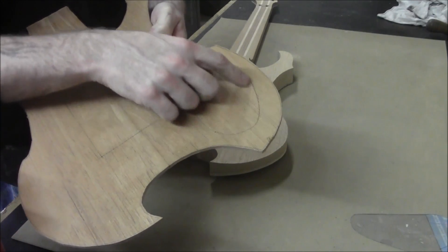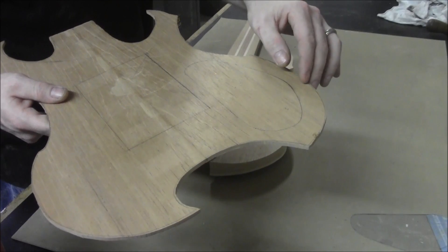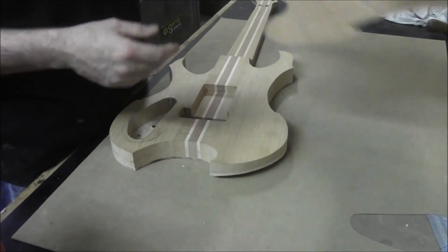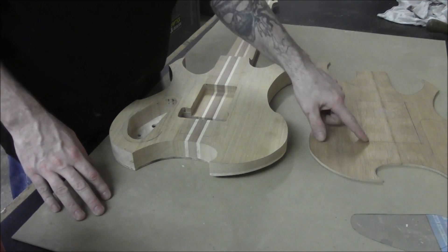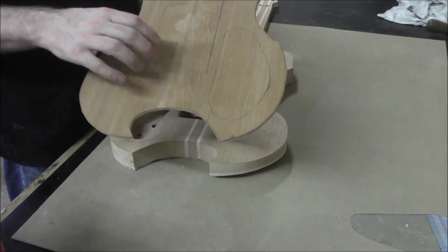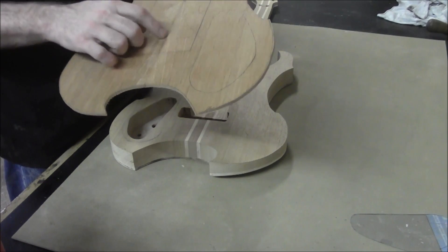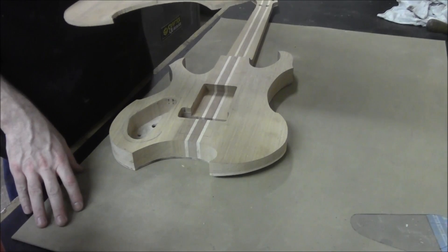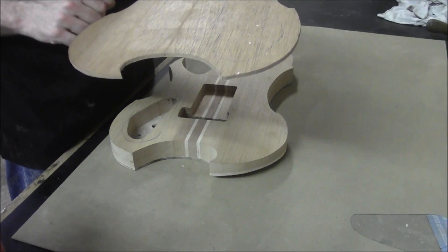On the circular type one, I'm going to do it all in one cut, so I really need just one access hole there. We'll set up the scroll saw and show you how we're going to do this to get it as perfect as possible, because we've got pretty much zero margin for error here. The more error in these cuts, the wider the gap is going to be between the body and the plate itself. We have to make sure these are nice and accurate so that whenever we slip them on, the gaps between the plate and the body are as small as possible.